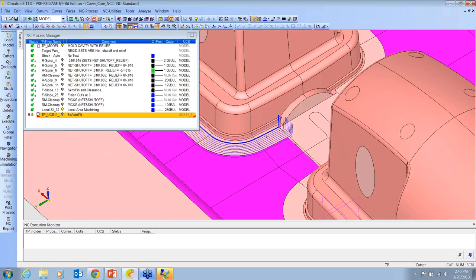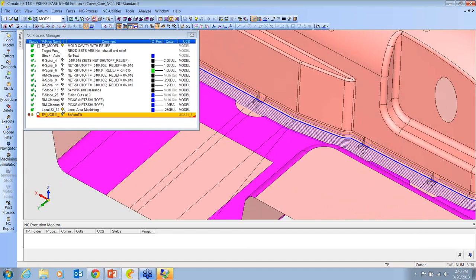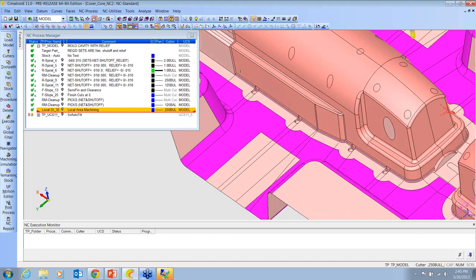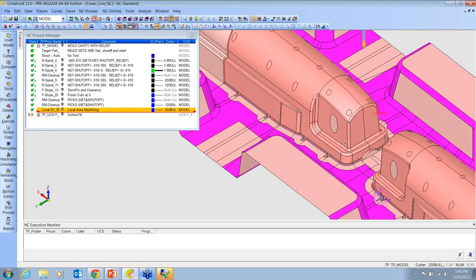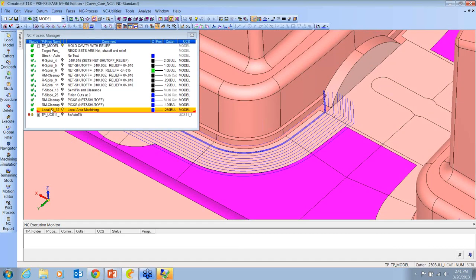And this is another kind of similar path that I wanted to show because it's kind of neat. I want to point out too, for better or for worse, that this floor is not flat. When we did that advanced warping and we tugged on that to bring it over, it made this floor's Z level change. It's not a lot, but it's enough where we can't just run a flat tool in there and call it good. So it makes it challenging to cut. You got to be able to have good tool control to be able to come in here and cut this efficiently now. And what I've created here is a cutter path that's a lot like a 2D cutter path, but it's not 2D. I want to kind of explain what I did.